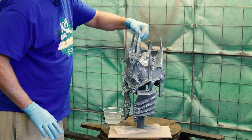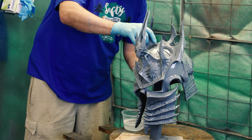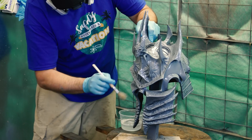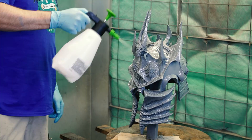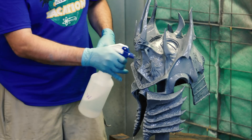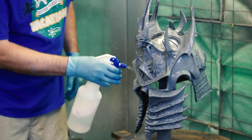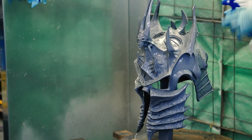First step of the seven-part process is washing the whole thing off with a little bit of soapy water — just some water with a drop or two of soap — to make sure you don't have any oils from your skin or any debris or dust. You have to let that last clear coat stage cure for at least nine hours. Then rinse it off with distilled or deionized water, rinse it off really good. Then you start in with the chemical process. P-Chrome labels these with just Solution W and Solution D. Put them in a spritz bottle — nothing fancy. You really, really soak it down first with Solution W, make sure you get everywhere, and then right away go in with Solution D, spritz it on everywhere. Then rinse it off with distilled or deionized water again.